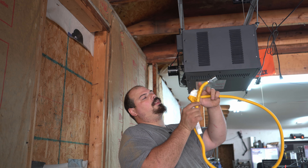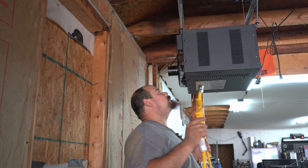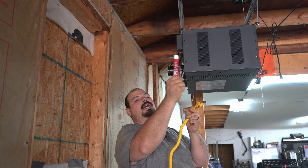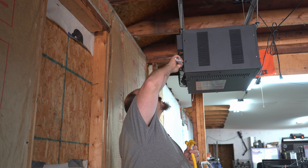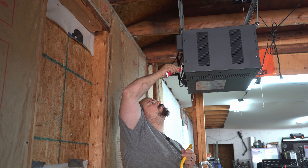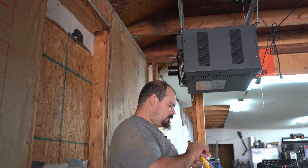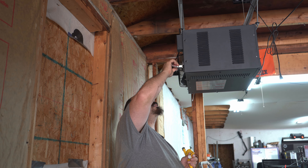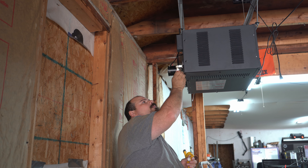I went and got one of these flexible gas lines for like a stove or a dryer. I had one around here but couldn't find it, so I went and got one of these. What we've got to do is put this pipe dope — pipe thread compound — on here. We're gonna put some all across the threads here; it'll thread in and do its thing. Just don't get it in the fitting. You don't need a lot; it'll kind of do what it's designed to do. Then we're gonna put this fitting on here. You don't really need to put the compound on the flared connection, but I do as an extra added measure — it doesn't hurt.